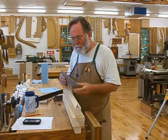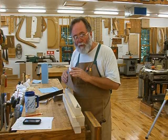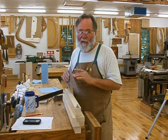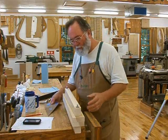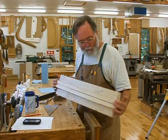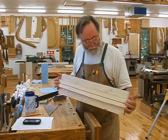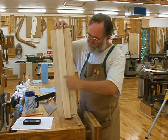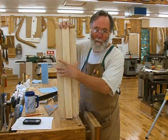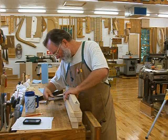And that gives you a saw cut edge, but that's not good enough. You need to have a really perfectly smooth edge to have a really good joint on your veneer. So I've got this little jig that I've made up. It's used to clamp packs of veneer. It's just two pieces of poplar with two strong backs bolted together. The strong backs have a slight bow to help clamp the center a little more tightly than the edges.